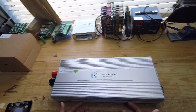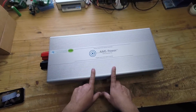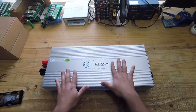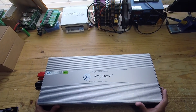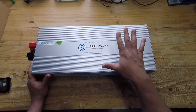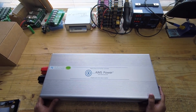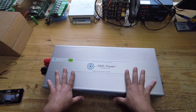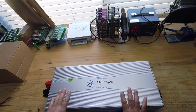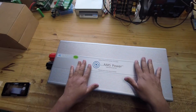The car requires clean power — it doesn't like modified sine wave and doesn't even like some cheap sine wave inverters. So this time around I got a $700 AIMS Power digital pure sine wave inverter. I'm not 100% sure if it's going to work. I know it's been successfully done with low-frequency transformer-based inverters, but those are big and really heavy, which defeats the purpose of a portable system. This unit is 100% digital — it does the voltage boost using MOSFETs — which makes it really light.